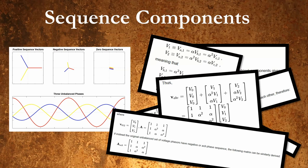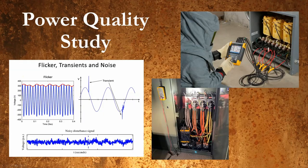Power quality studies are used to help engineers sort out a myriad of problems that can plague electrical systems — from intermittent utility outages, flicker, and harmonics issues, to prolonged under voltages. We can determine the cause and identify a solution. Typical power quality studies are performed by temporarily installing very accurate power meters that log conditions and events over a week or a month of normal service. We can also perform a load study, where we install a meter for a month or more to tell an engineer if existing electrical infrastructure like transformers or switchboards have enough room to safely add more load without overheating.